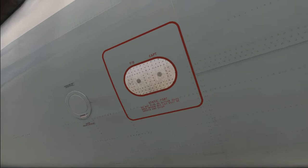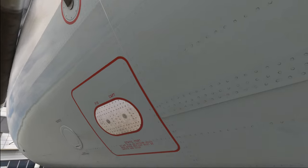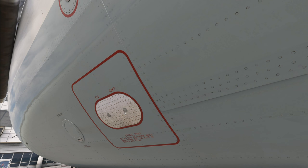Also quite important when checking static ports is to have a little look from the side. If you look very closely, you can see a slightly different coloring next to the actual port. That different coloring can come from maintenance which might put stickers on there when performing maintenance action or repainting the aircraft. There might be stickers and blockers on there which has in the past caused aircraft to crash when the static ports didn't work. So be very careful that there is nothing obstructing those ports.